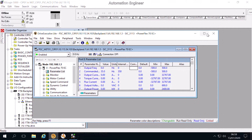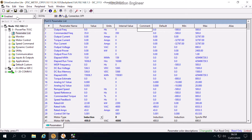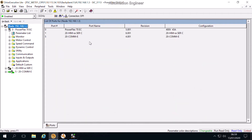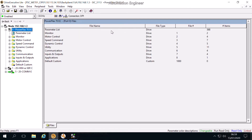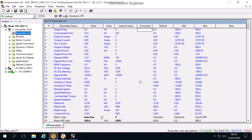Expand it. The status is enabled and the connection is good. This is the model of the PowerFlex. We click the revision. This is the group of parameters — separated into Monitor, Speed Command, Utility, and Communication. Here is the list of all parameters of the VSD. The parameters are being exchanged, which means we are online already.